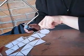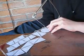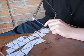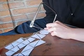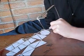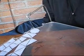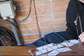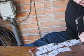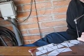Now, I'm only promising this is going to work, I'm not promising that it's going to be easy. You push against the blade with your finger, create like a little niche right there to get bite in. And don't push too hard because that'll make it catch and it'll jump and mess up your straight line. And at a turn, you just kind of leave it stationary, pull back maybe just a little bit. Just keep turning it as you keep going up and down.